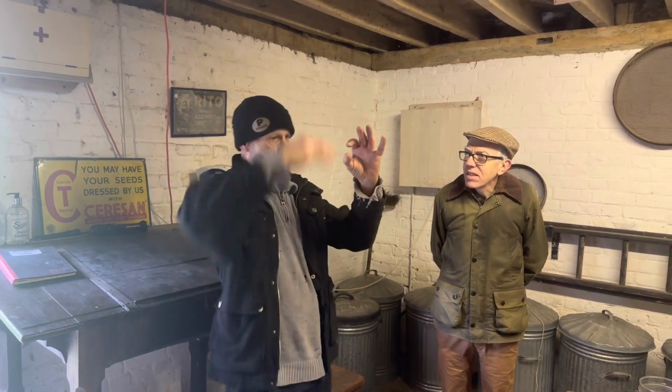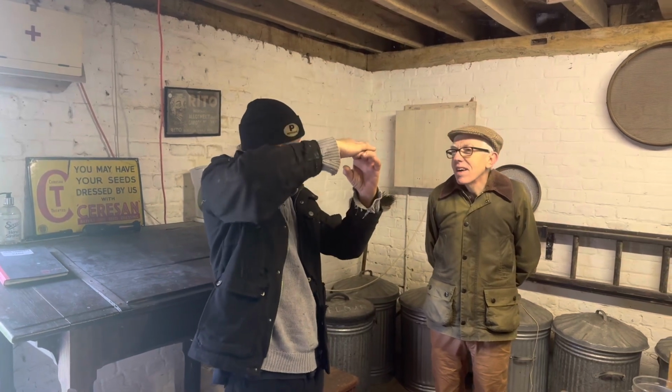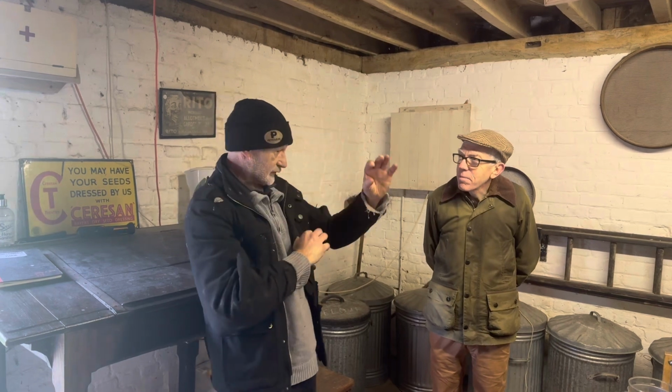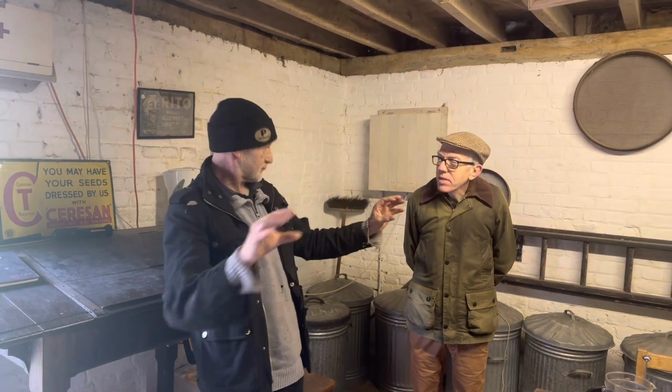It never occurred to me there were different sorts. I thought wheat was wheat. It never occurred to me there's different. Yeah, no, it was an older type which they call Maris Widgeon. And it was a bit of a job to mill, first of all, because our grains are, say, this size. And so when you bring the stone down, you know roughly where it gets set. And because it doesn't vary much year to year, slightly smaller, slightly bigger, but we use pretty much the top wheat we can get. All of a sudden, these grains come up and they're a third of the size.